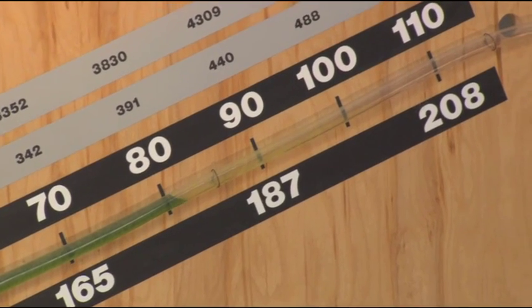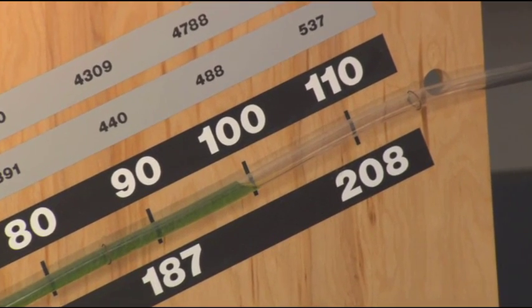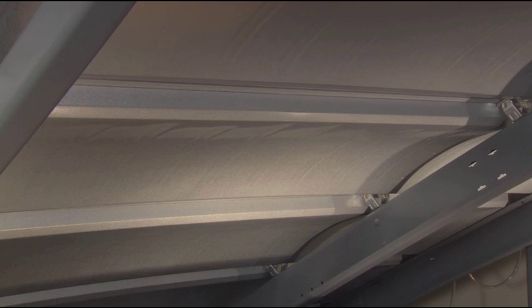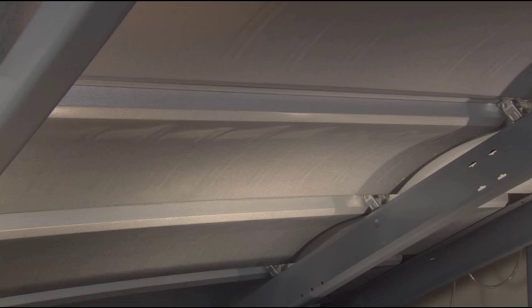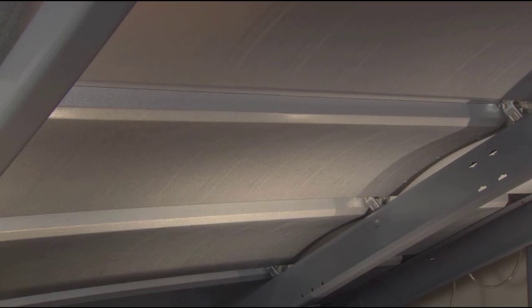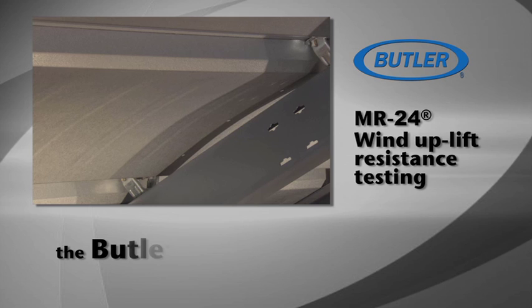If you've passed this level of performance, you continue to test to the next level, which is a UL class 90 — that's 105 pounds per square foot, equivalent to a 200 mile an hour wind pressure. At this point you can see the deformation. One of the things I always like to point out: the seam that we make with this panel won't come apart. It might kink in the middle or at one of the supports when it breaks, but you still have a weathertight membrane inside the building. We're actually pulling a vacuum on this seam — nobody else could do this, their seams are so loose that air would flow through. We have to put a plastic sheet under it to test it. In this case, it's not only watertight, it's also airtight. And so long as that deformation is not permanent, it returns back to its original configuration — you've not exceeded the elastic limit of the steel — and you can do it time and time again. It's all part of the Butler difference.